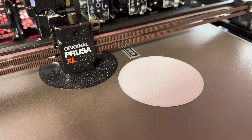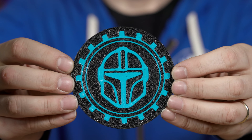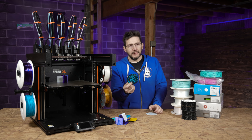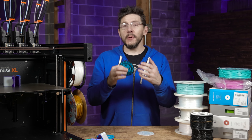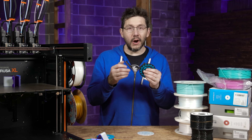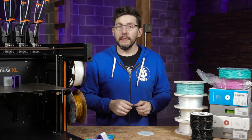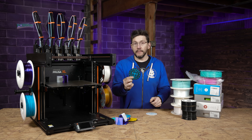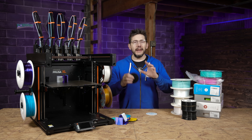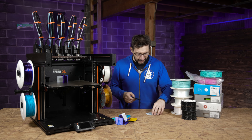This was the same batch: blue for Din Djarin, then black and white. The black is a Polymaker Flexible 95D, but it had been left out for years. It had absorbed moisture from the air — flexible filaments are hygroscopic, meaning they can absorb moisture from the surrounding air over time. I believe that's what caused the jammy jam. It still looks cool, but I sent it to my food dehydrator so it can live another life, hopefully nice and fresh and ready to print again.